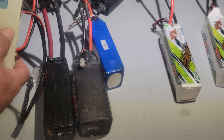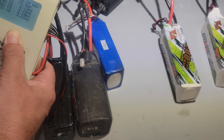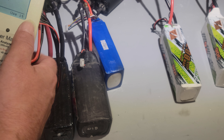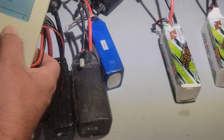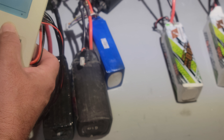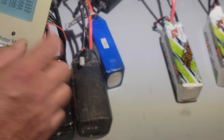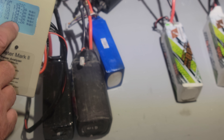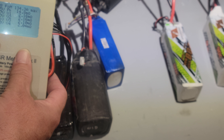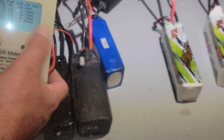17C. But it's off - we're going to have to change it because this is only a 6,500 milliamp. So let's bring that to 6,500. Use it. Now we've got 21C and 136-138 amps. Pretty close on the amperage, and all the internal resistance is between 2.0 and 2.16.